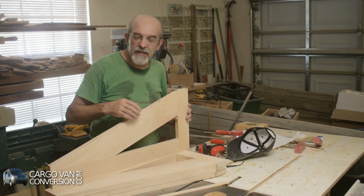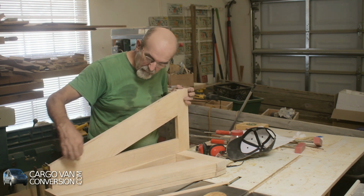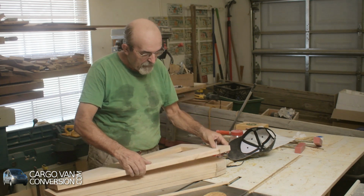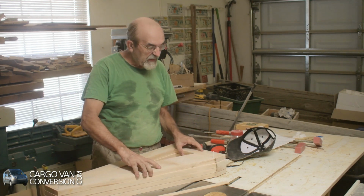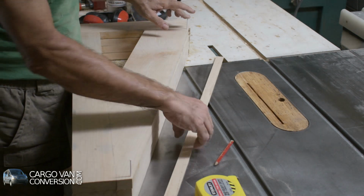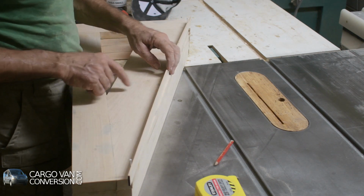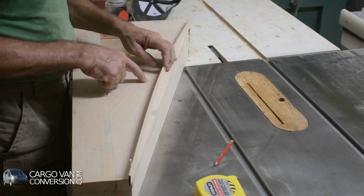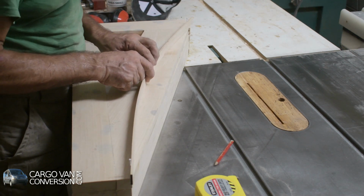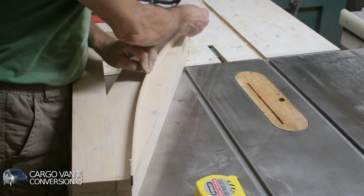To save a little bit of weight and give it a little bit more form, I'll make a curve in this wood, so I'll take a lot of weight off of that. What I did is, I put two nails here in the corners, took a little thin strip of wood, and I calculated that I wanted to do that approximately 1¾ inch inward, so I'll just bend the wood at the center to what I wanted to have.